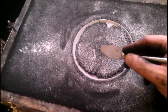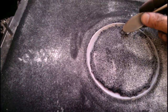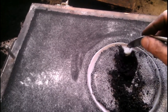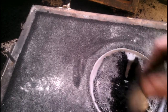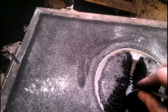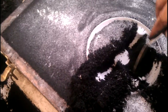What you can see now is that the pattern is trapped in the sand. We've got to part it out — get everything that's on top of the pattern out of the way. I know I've got a spoke right down here because that's where the handle is going. I'll follow this down, find the center of the hub right there, and of course there's going to be another spoke right over here — and another one coming out this way.